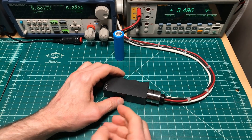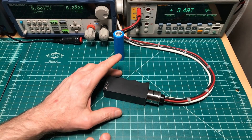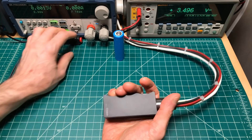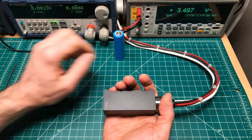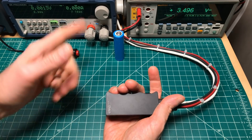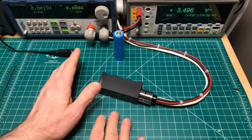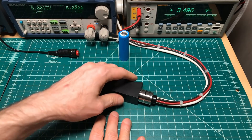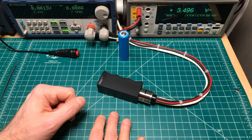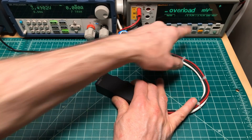To prevent any arcing damage from affecting the voltage drop reading, I press the button, fire a two-second pulse of current, then read the voltage drop, the current stops, then I let go of the button. So I'm never pressing, stopping, and starting current flow with the button, so there's never any arcing or damage. Later on I'll use a battery and a resistor and fire 200 times to simulate vaping and check what kind of arcing damage, if any, is in the contacts.